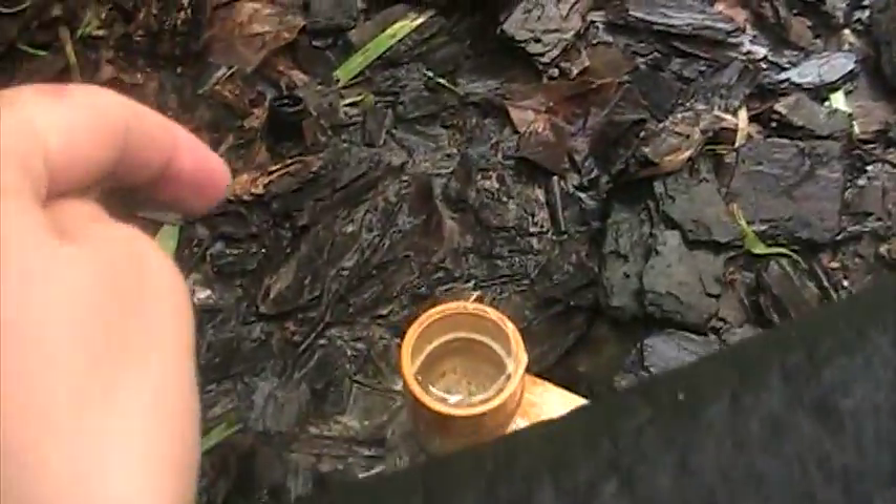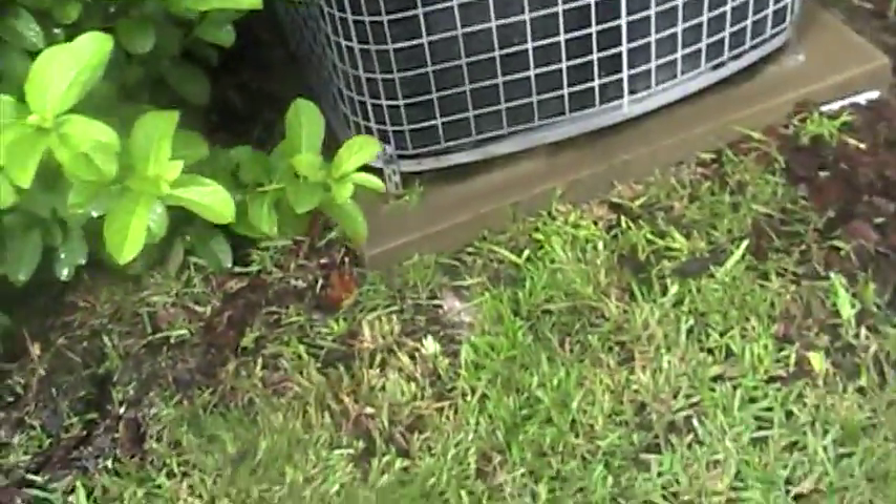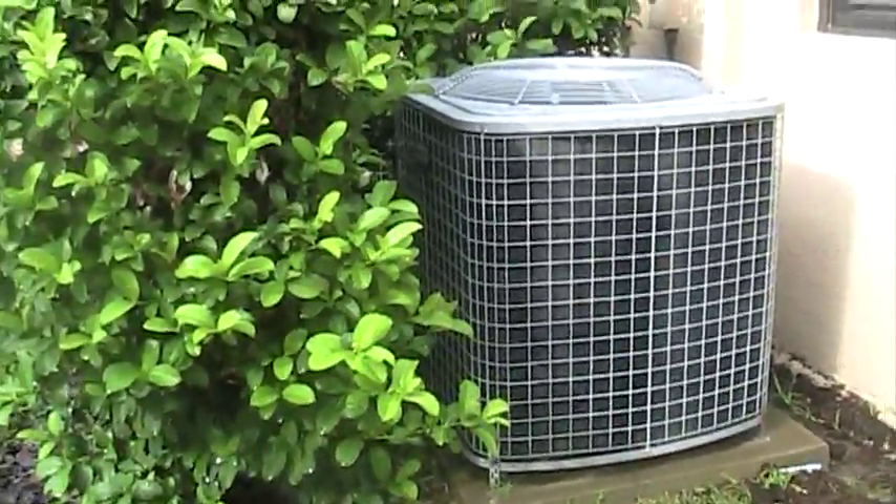I'm going to take off the condensate bubbling up instead of installing a trap. That's what they did — that's totally a dumbass move there. The serial number on the five-ton unit is E062005140, so it's from the 20th week of 2006. The model number is N2H360AKA100. It's got R22 as well — 15.5 pounds. That would be like half a bottle or half a jug of it.